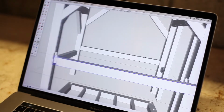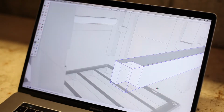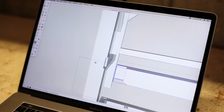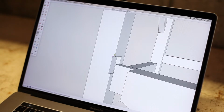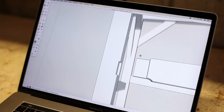Let's see if I can get this over here correctly. On one side, like this. So barefaced tenons for the girts and for the doorpost. And then we also go back to this idea of reducing the timber to get a measurable size within a timber that may not be uniform. So we're going to come in 5.5, and this section here will absorb any of our variance in the timber. So we're just going to get started cutting these to length and then starting on the tenons.